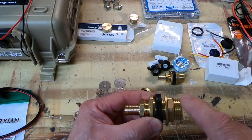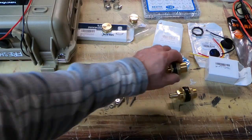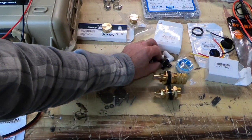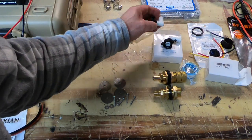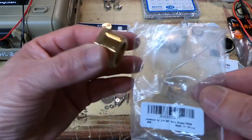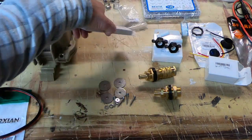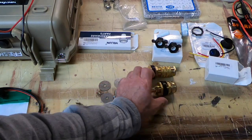You need two of those and two of these. One of these will go through — this is a GHT, a garden hose fitting. For the other one you're going to need this connector, which is garden hose female-female. You'll have two different connections so you won't get messed up with your hoses when connecting. You're also going to need a box of barbed fittings to attach to the pump, and it comes with some Teflon tape. I went with this plug to seal off one side, and then a cap to seal off the other end so no dust and dirt will get in when not in use.